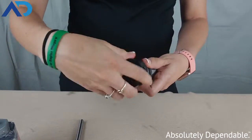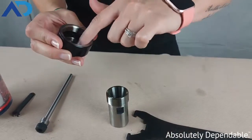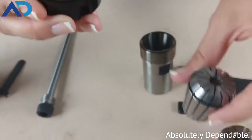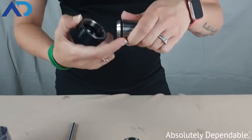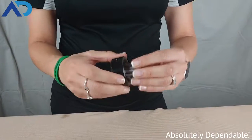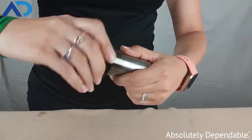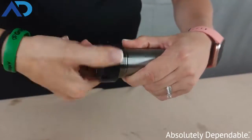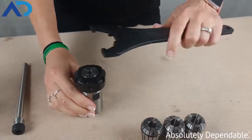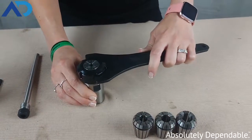What you do is you twist off this collet nut. You can see there's a groove on the inside just on the lip, and you take one of your collets — the collet also has a groove. You clip that directly into your collet nut and it locks into place. Once it locks into place, you can thread it back onto your collet chuck. Once again, it's the same concept: once it's hand tight, you can use your collet wrench to tighten it and loosen it.